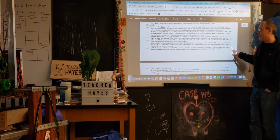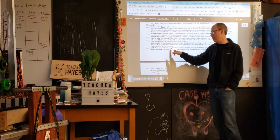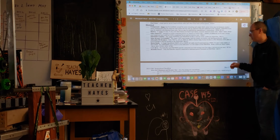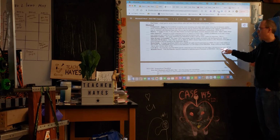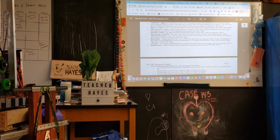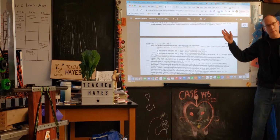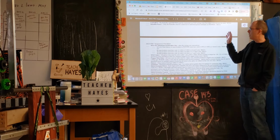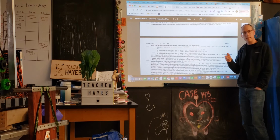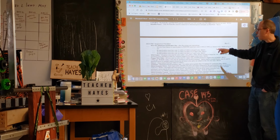The CAN, they basically insist, even if you weren't to use CAN and use something else, you still need to have the RoboRio to the PDH connected, which is fine. They want the RoboRio to be dedicated, so a single line on that. One thing that you can do with DC power is connect a lot of stuff on a bus. They don't want you to do that. Part of this is because they're trying to enforce best practices so you don't have a bad experience.